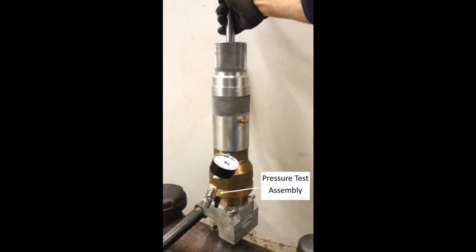Fully retract the drill shaft and hold into place to prevent it from pushing upwards. Pressurize the assembly by introducing air or nitrogen through the Schrader valve and test to mains operating pressure. Make sure the small valve is fully closed. Perform a leak test on the assembly and if necessary, further tighten seals. When the leak test is complete, open the small valve to release pressure.